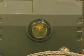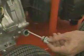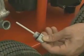For gas or electric jets, check the inlet filter before each use, and periodically check the oil level in the pump. For gas jets, you should also periodically check the oil in the engine. Use a three-quarter-inch heavy-duty water supply hose — this type of hose will ensure that enough water is supplied to the pump. An insufficient water supply will cause cavitation and damage the pump.